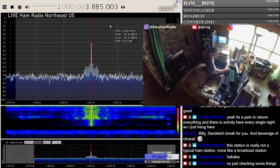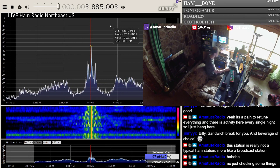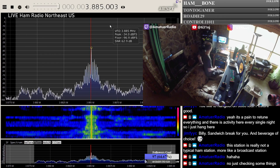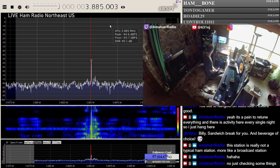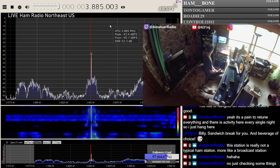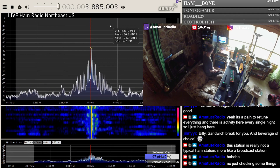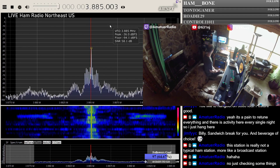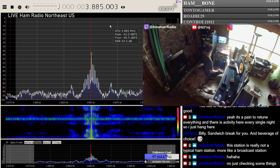I was talking to Clark about — I want to get a Cobra 29XLR with the 858 chip in it, and I want to do it up with 5 kilocycle spacing, so I'm going to do 28, like 965 or something like that, up to like 28, 29, 200 and whatever it's going to be, right in the middle of the AM band on 10 meters.